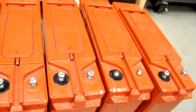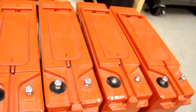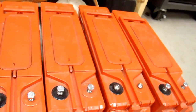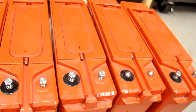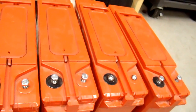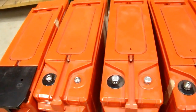I'm going to do some testing to determine if equalization is necessary. For a standard lead acid battery with caps on it, I would recommend putting it on a charger at 15–16 volts for four hours, possibly longer depending on condition, and just let it boil away. You can then add distilled water afterward to bring the electrolyte back up to the proper level once fully charged — you don't want to add water before equalization because it may overflow, as things change size inside the batteries. With these AGM batteries, I don't have that option, so I just charged them ordinarily without any equalization.